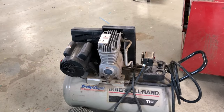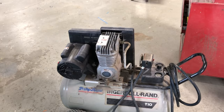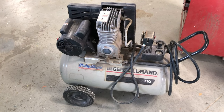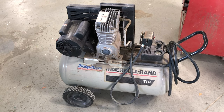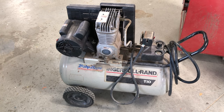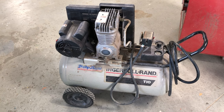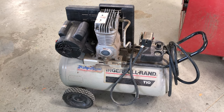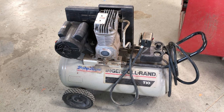This slightly larger compressor — you could do a car with this, pretty easily. You could even get away with a smaller one. We've taken this onto a few jobs and done some pretty big sprays. This is rated at 6 CFMs at 90 PSI, around 7 at 40 PSI. It still won't keep up with the gun if you're spraying continuously, so even on those jobs we did have to wait for it to catch up here and there.